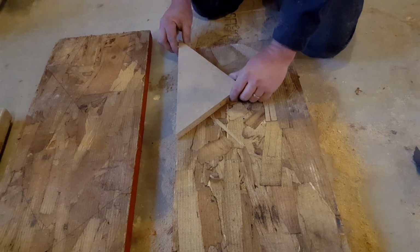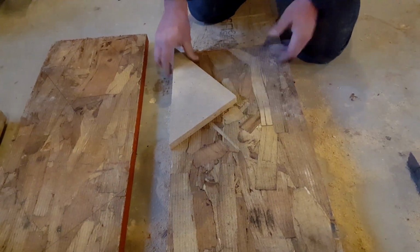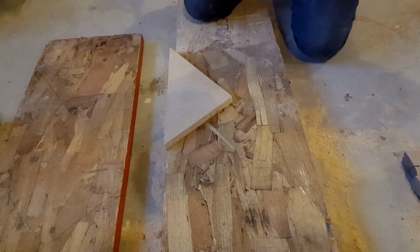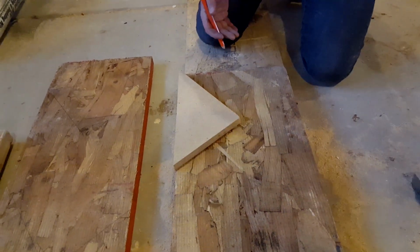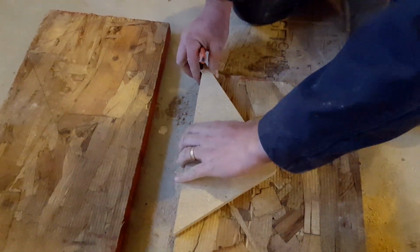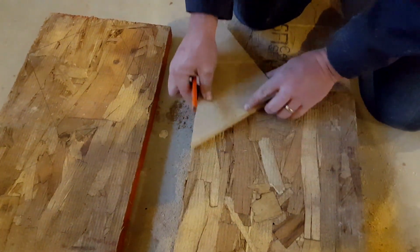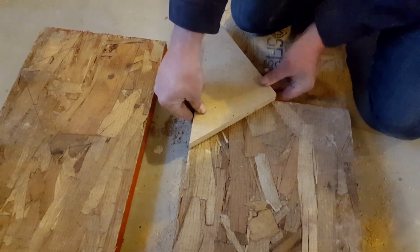for stair stringers. So the first thing that you want to do is figure out what the material is that's going to go on your stair tread itself that you're going to step on. In my case, we're just going to put some 2x material. So I've got just a scrap 2x4. So I'm going to pull this down. I've got my cut edge that I just made. I'm going to lay that on the side of my board here. So the first thing I'm going to do is just hold it, make sure that I'm flat with the edge, and pull it down until this corner meets.